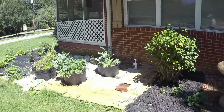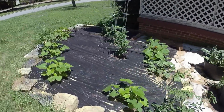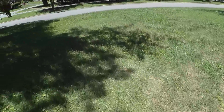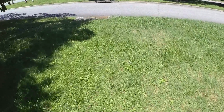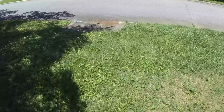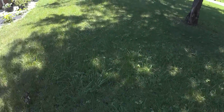We're gonna go ahead and catch this gutter while we're here. And there's a sump pump drain under here somewhere too, which we're gonna grab. And we're gonna take it right over here into the city stormwater drainage basin. So we're gonna dig down right here and core into their basin. I called the city and got permission to do that. So this should be a pretty good system.